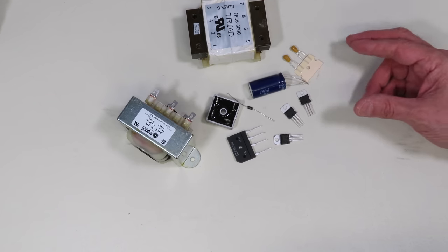Now that we've covered all the theory behind linear power supplies, it's time for the second half of the video where we actually build a linear power supply project. The power supply I'm going to build has a positive output, variable from about 2 to a little over 20 volts, but it can also be switched into three different fixed voltage outputs — 3.3, 5, and 12 volts. I've got links for all parts used in the article on the dronebotworkshop.com website, but you could also use this as a guideline for building your own supply, especially if you already have an existing case or power transformer.